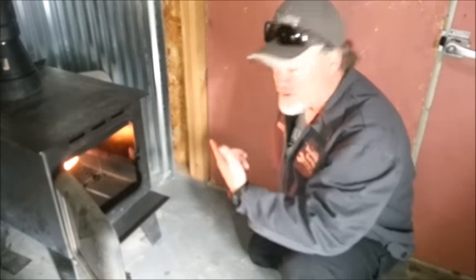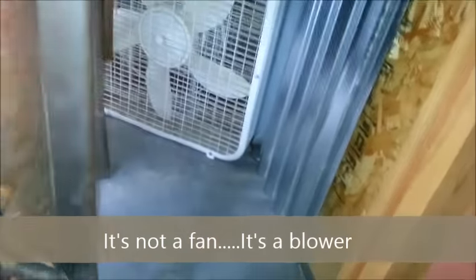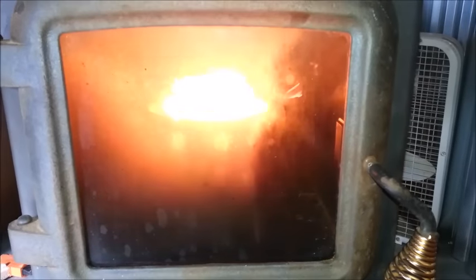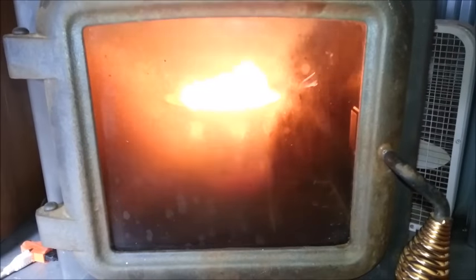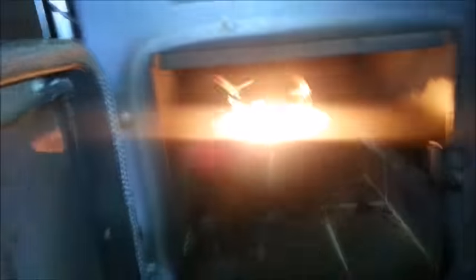There you have it — a nice, clear flame. It's settled into a real good flame. I've got the door open and no residual smoke. With the fan going, you've got a forced draft with a little natural draft to help. It's heating up real nice. I've got awesome control on this, and one of the reasons is because it's just a real small stove. I adjust the fuel flow, not the air flow, and it doesn't matter from a low to a high amount of fuel — that little mattress air pump does the trick. Works great.